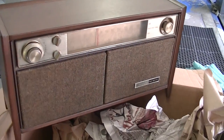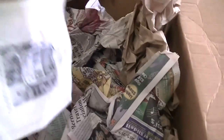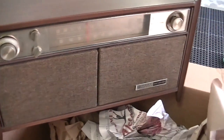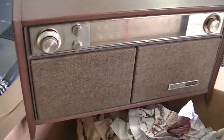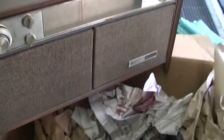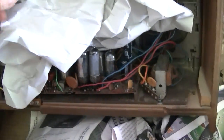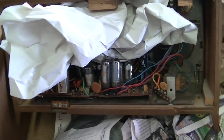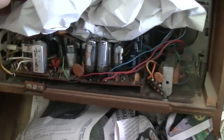This is from Audubon 5425 and this was kind of an unboxing that went wrong. He had thrown the SAMs in there and it was just crumpled up and looked like a piece of newspaper. This is one of those mid-60s General Electric radios that are extremely hard to work on, that always have the IF transformer problems, and he's pretty much narrowed it down to that. He just doesn't have time to get into it with the new additions to the family, so I said send it on over. I've knocked out a bunch of these now, so I should almost have the values figured out — I just have to go through my notes and previous videos on the IF transformers.